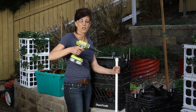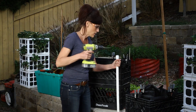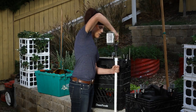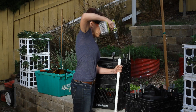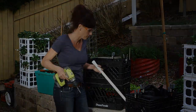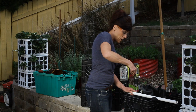I start by drilling a hole with a 5/32 inch drill bit — you don't want it to be too big but you don't want it to be too tiny either. I drilled a hole in the end so the water can drain out the bottom. Then I drill holes all the way up the pipe about three inches apart, going all the way through to the other side.